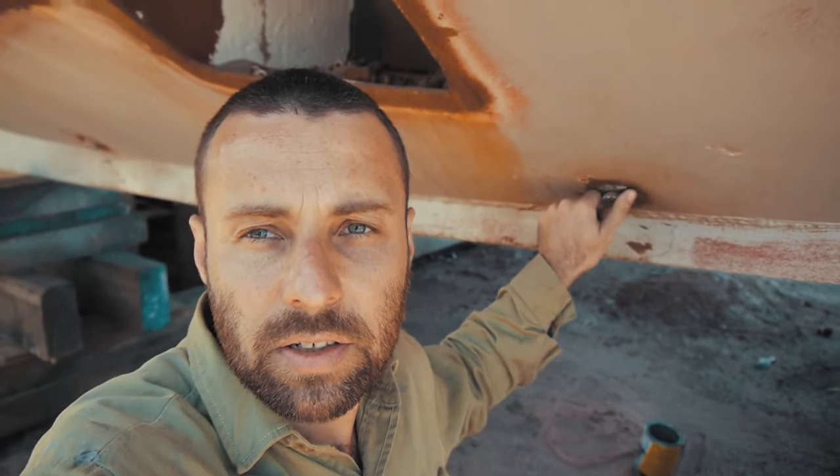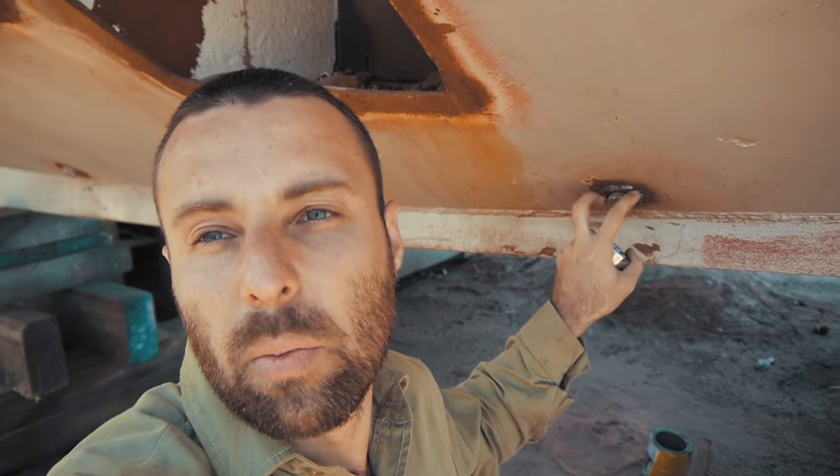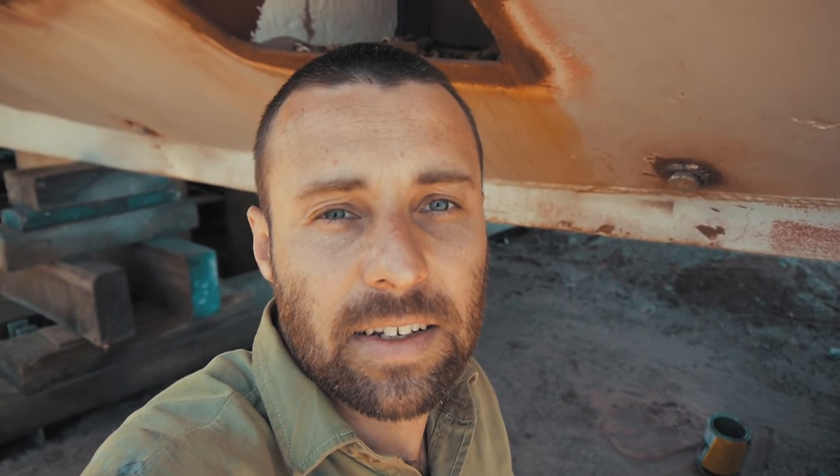Part of emptying out these fuel tanks of sand after blasting, I've got 1-inch 316 stainless bungs in here that I need to remove so I can drain the sand out. The trouble is this one has gone a bit oval-shaped from welding and has locked up. I've tried a big 36-inch wrench and it's not moving — it goes a quarter of a turn and then jams again. My plan is to hammer a socket on nice and tight, get my ratchet in there and crank it off, then run a tap up there to clean it out and make it more round. We'll get a new bung — this one will probably die, but not a worry.